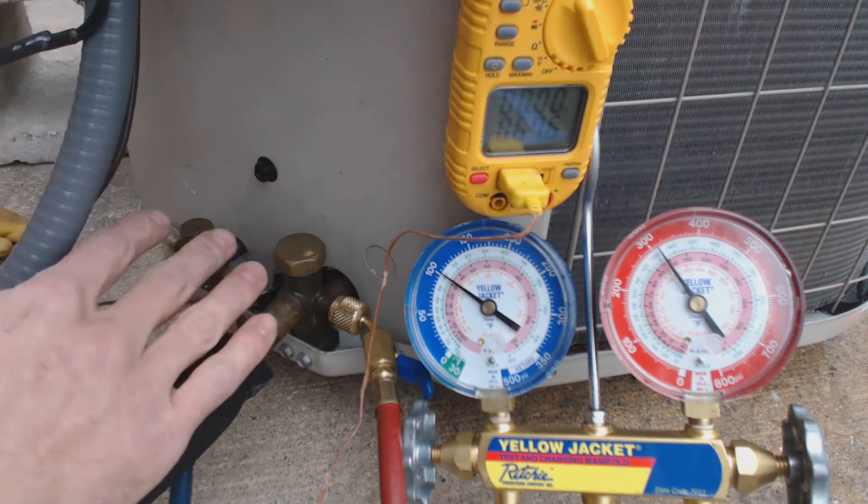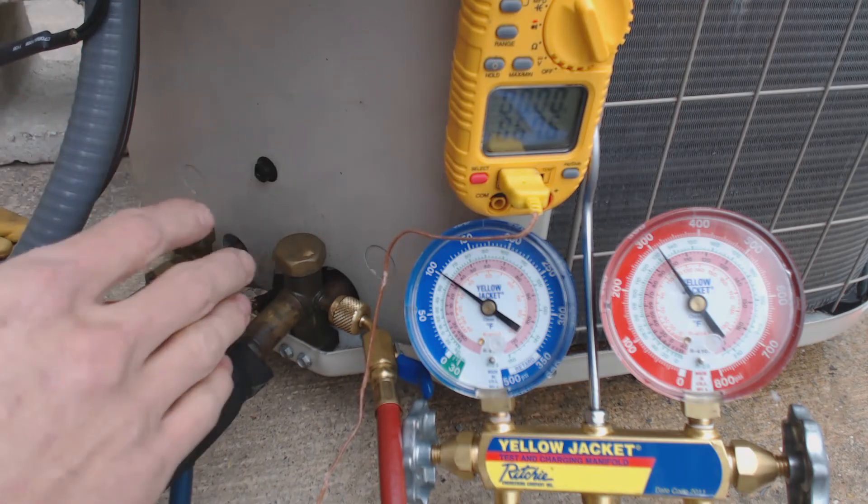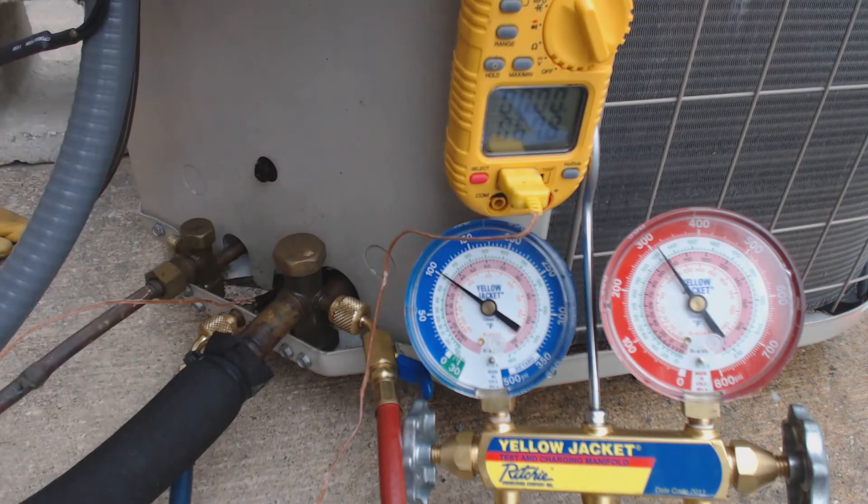But in this case, we're running in heat mode and it's wintertime, but it happens to be a kind of warmer day outside — right around 60 degrees right now — so the heat really shouldn't be turning on and off that much to actually heat the building.